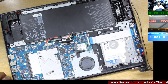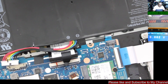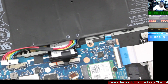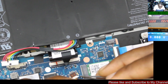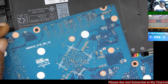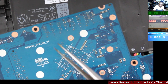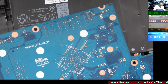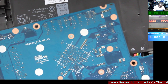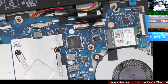So what I will do now is program the chip — you see this 8-pin chip here. I will program it with a clean region file. The board number is NB8609 PCB. There are versions V4, V5, and V6. So when you are getting your file, make sure it's V6. Don't use another file to program this board. When you are programming that chip, be sure you are using the correct file.